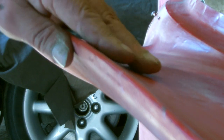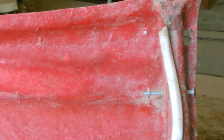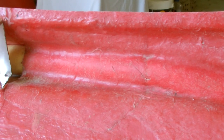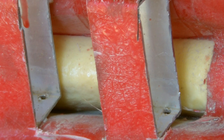There are a few ways of joining together fiberglass parts made in two or more matching molds. In this case I just used a bead of body filler, brought the two parts together, put some tape around it, then sanded it and got a seamless appearance. Another way is to fiberglass them together from the inside for extra strength. I've also filled the tail wing itself with pouring foam for added strength. Either of these three methods would have done — in my case I just did all three for overkill.